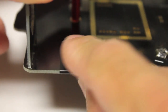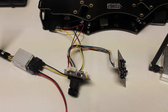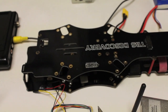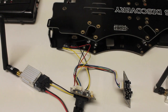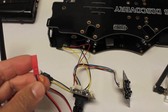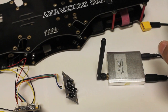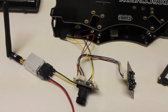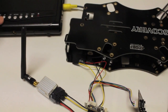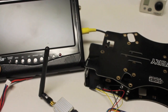I've put a little piece of electrical tape just so we don't stress these solder joints. That really should be all we need to do to verify that our electronics are working. I'm going to power the TBS frame with a 3-cell LiPo — about 11.1 volts — and I have a separate LiPo to power the transmitter and receiver. Another LiPo stays on the ground to keep the receiver powered. So we're going to connect everything and take a look at our little LCD display to see if we can get the picture from the camera.